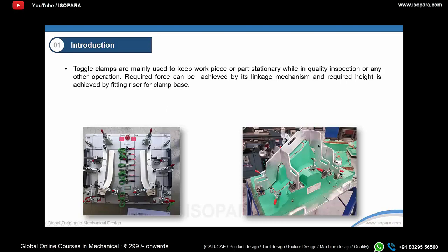By this time you are very familiar with the checking fixture and its purpose. If you look at the fixture here — this is the gauge — the part, which may be a sheet metal piece, should match the shape of the fixture surface. You simply place the part to be inspected over it. However, the part can still move in certain directions and rub on the fixture, so we need clamps for that purpose.